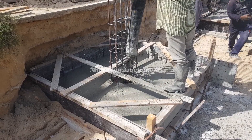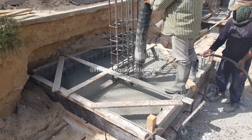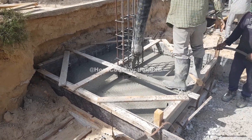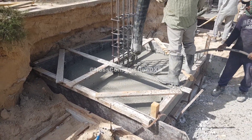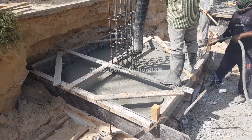There are two reasons for this. First, it helps evenly spread the concrete and ensures the concrete reaches all four corners, so there is no need to drag the concrete manually. Second, it gets all the air bubbles out of the concrete so it does not compromise the strength of the concrete.